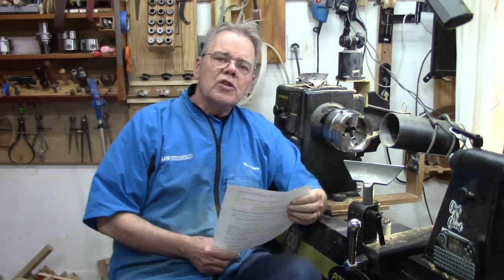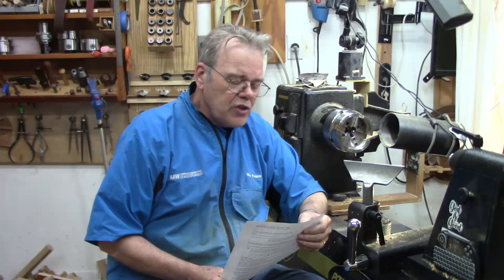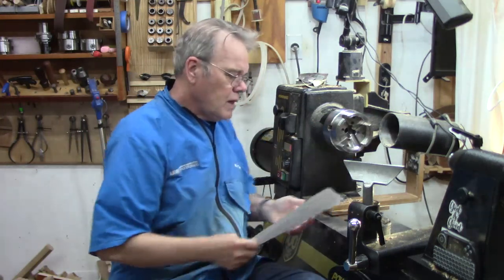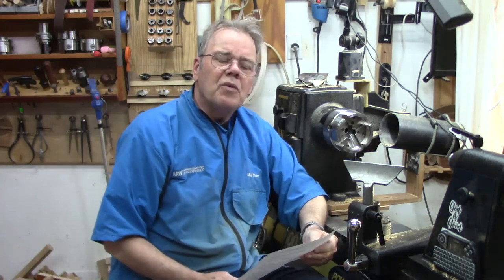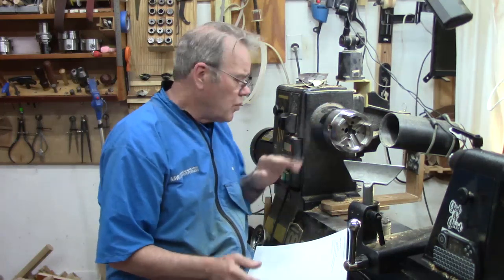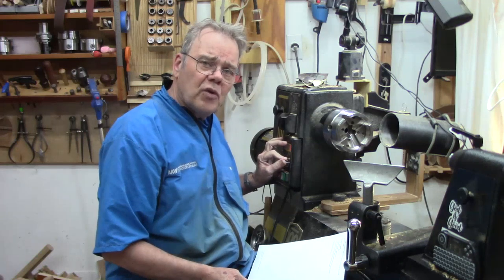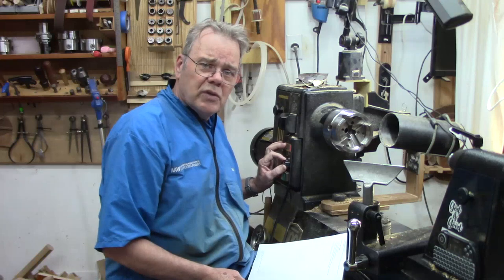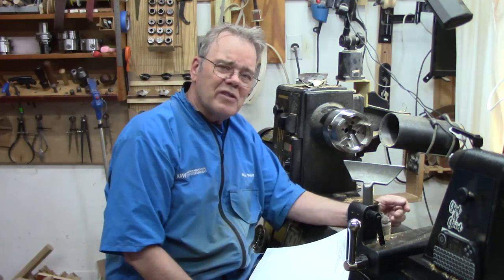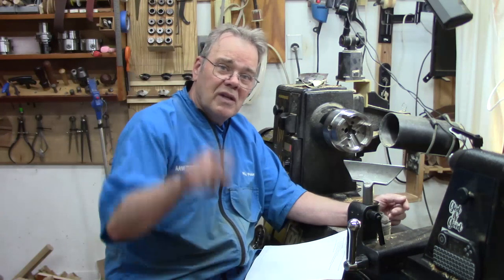So what are the solutions to prevent this from happening? Number one, don't use the lathe in reverse. Also, put on the chuck with a slight flick of the wrist — make sure it's locked, just give it a little pop. But I think the most significant takeaway for when you're turning the lathe off is: don't hit the stop button with a large lathe project, especially if you've seen it has a tendency to happen with your particular setup. Slow the lathe down with your speed control to bring it to a stop. And of course, the last solution a manufacturer suggests is to use your set screw to hold it on if you've got any concerns at all. Remember y'all, stay safe and come on back.